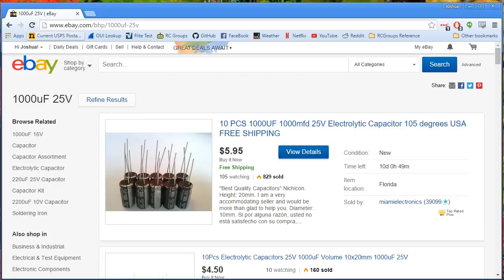If you are using one of today's high-performance ESCs — like the Little Bs, the RG20s, the U-Bads — any of these ultra-small, very high-performance ESCs with the active braking and all that, your copter's electrical system is a mess. These things put so much noise back onto the system. I've heard Quad McFly talk about how he's seen as much as 4 amps of reverse current from the active braking. It's just a mess.